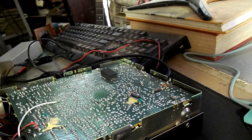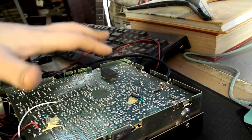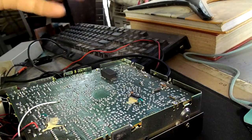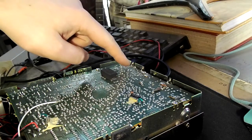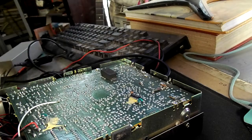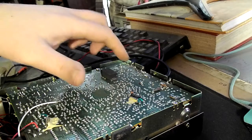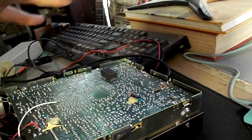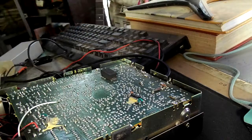A word of recommendation before you start soldering: make sure you unplug and turn off all of your equipment before you solder it. Because you do not want to create a solder bridge while the device is on. A solder bridge is when you use too much solder and two solder joints touch, or you pull away your soldering iron and drag solder to another joint. That'll cause a short, it can bypass circuitry, and it could destroy your radio.